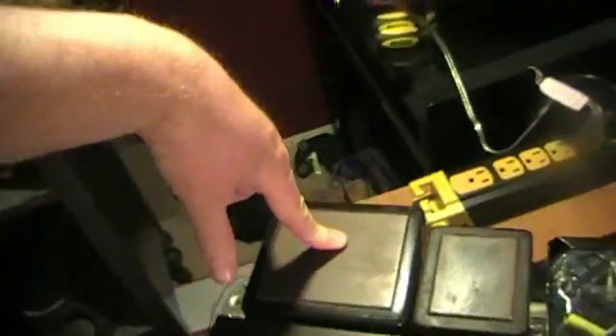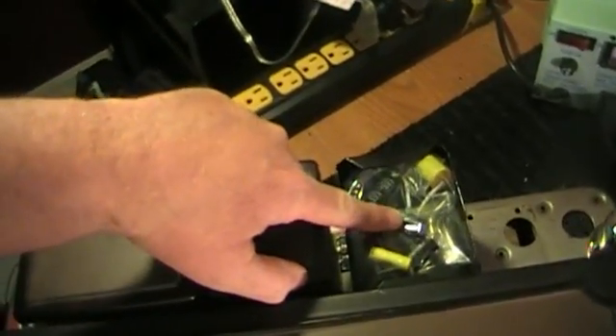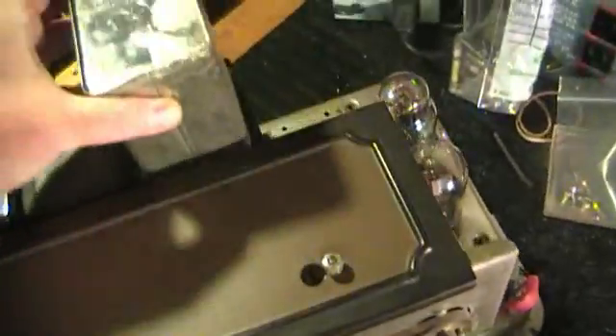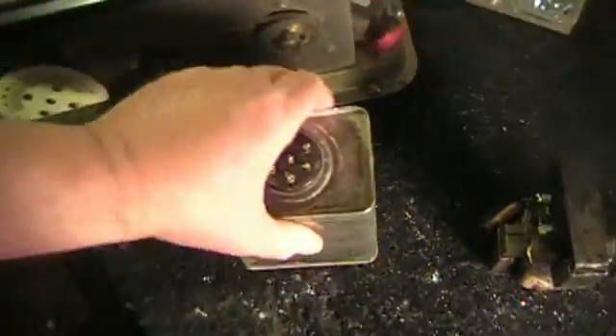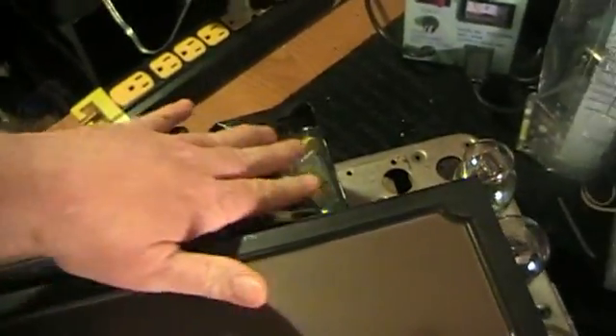There are four cans on the back of these chassis. They have a power transformer can, an IF coil can, and a can that's filled with capacitors. You can see what I've done is replace the capacitors just in the can. Originally they came in this doodad that sits down in that can — a huge set of capacitors with all the leads coming through. Some guys like to restuff these; I didn't take the time to do that. I'm just going to replace it altogether with these capacitors, put in a plastic bag to keep them from shorting out on the inside of the can.